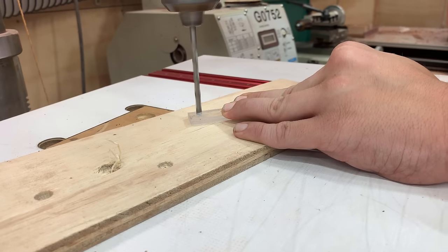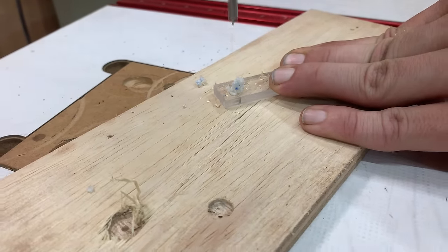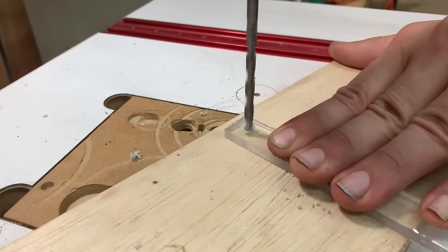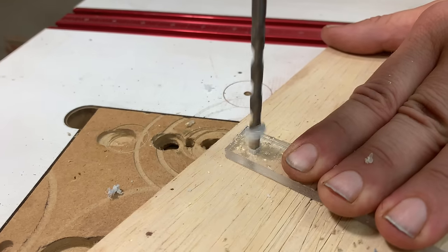It's really cool to see the squirrel open it up to get the peanuts. Acrylic cuts and drills just fine — you just need to move a little bit slower. If you're drilling a hole, drill through a tiny bit slower than you would with wood. And if you're cutting it, push a little bit slower through the table saw, and it cuts just fine.